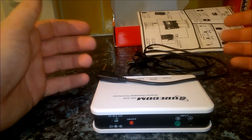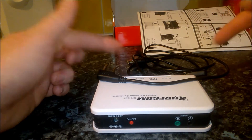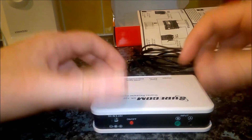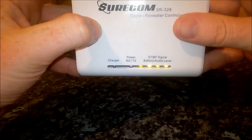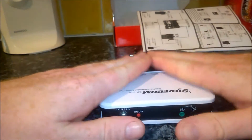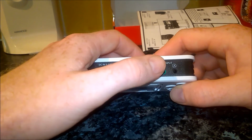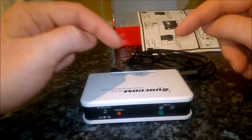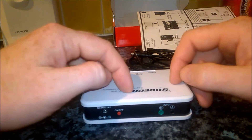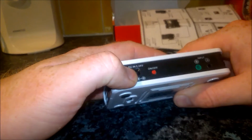A lot of cross-band handsets and mobile radios work both ways, which gets complicated. This controller will only receive on the designated receive radio, preventing feedback loops. It turns two radios into a full duplex repeater. It's advertised as a cross-band repeater — you can have receive on 144 MHz and transmit on 433 MHz, or run it on the same band as a two-metre or 70cm repeater, whatever your radios are capable of.